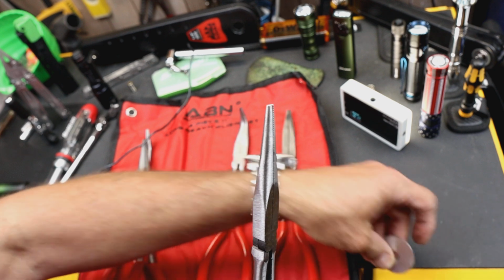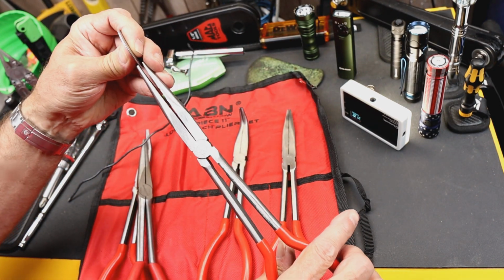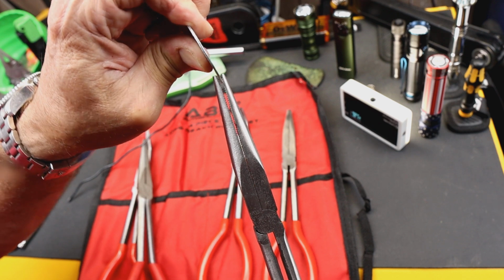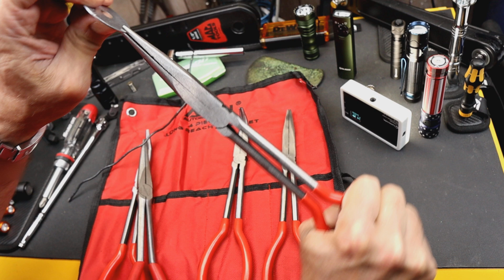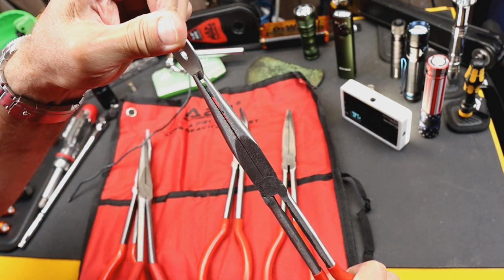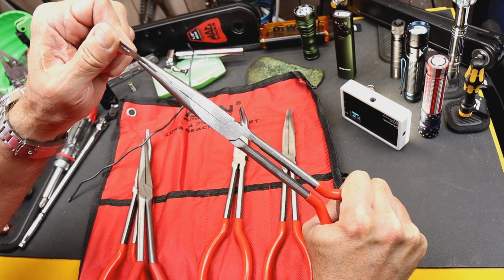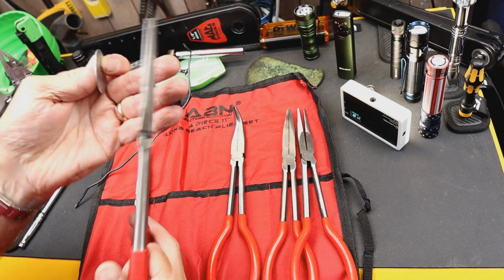Another test is the twist test. I've got just a small, or a thin, fender washer here. If I put this in about 1/4 inch, just like that, I'm going to do 2 things. One is I'm going to pry it this way, just to see how these handle it. I'm not giving up anything right down there. And then the twist to pry them apart. Again, you can see the lower part of the handle, I'm not releasing that at all. Compare that to the Snap-on.